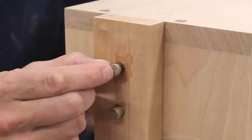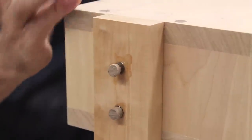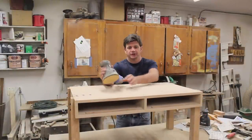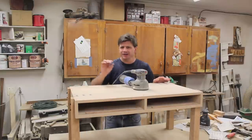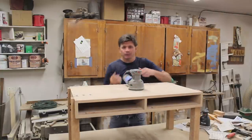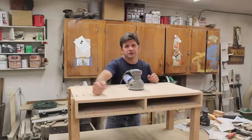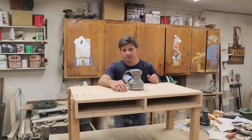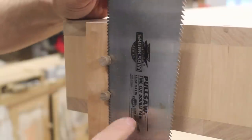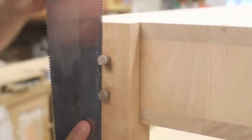After I removed all of the glue, I let the legs dry, and then I made a few walnut plugs. The walnut plugs are held in with 5-minute epoxy. While the epoxy is setting up, I'll sand the top. If you want to know more about these plugs, I'll put a link on the screen. I'm going to use the 80 grit sandpaper in my disc orbital sander to sand the top — because the legs are maybe a 64th of an inch high, this will just cut those legs flush with the top. Once I finish sanding with 80, I'll flip the table over, cut the plugs off, finish sand the legs, then flip it back over, final sand the top with 120, then hand sand it with 220. I'm using a pull saw to cut the plugs flush with the legs — I'll cut halfway through the plugs, then bring the saw to the other side and cut the rest of the way.